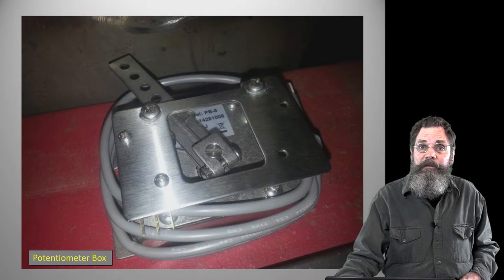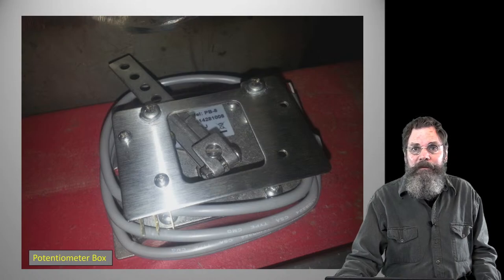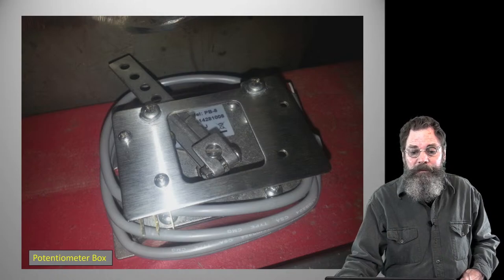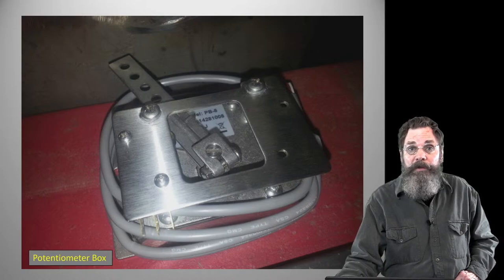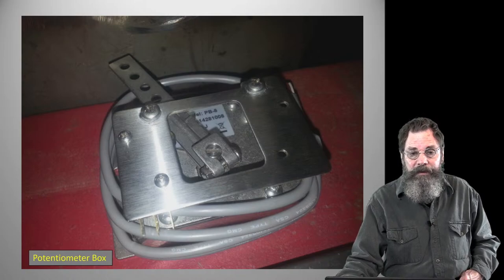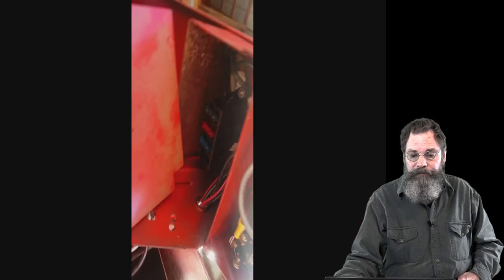You don't want it to fail at full speed. Not that the tractor's extremely fast, but you maybe have a situation where you lose your head for a second thinking, well, how do I stop this thing? Because there's no clutch. So basically you throw the throttle back to zero or neutral, but if something's broken, it's not going to do anything. So that's why we have that marine switch. We can put the gear shift in neutral if we have to, or just shut the power off completely to the whole traction system. And that's the way to do it. That's why it's in a very accessible position.